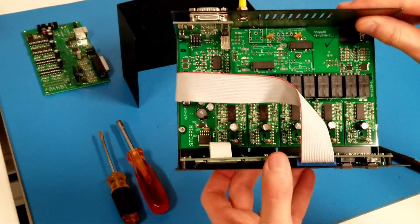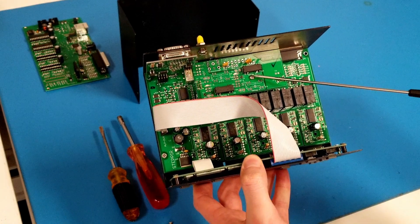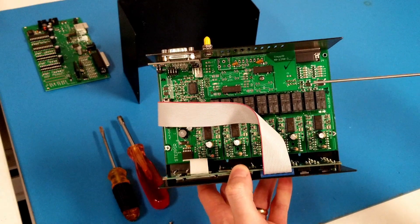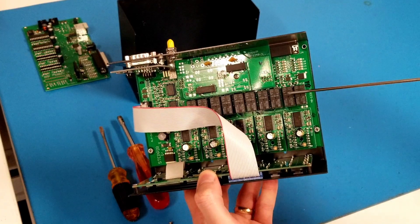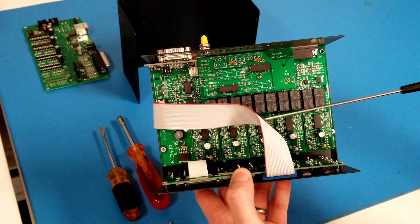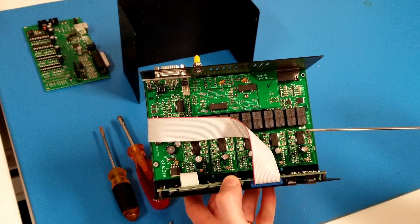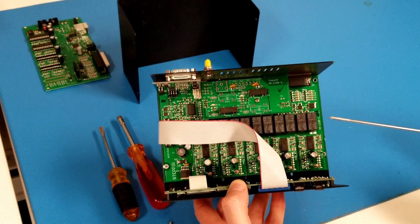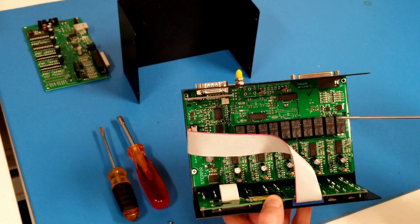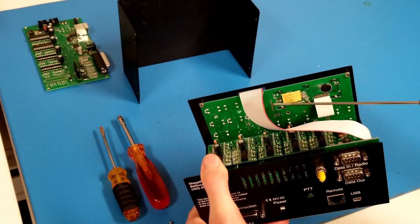With the cover off, I can see inside the controller. There's a transceiver interface board installed and a relay board installed. The driver board here is an ALP5 driver board — you can tell it's ALP because of these relays right here — and you'll see that there are five driver chip modules installed: U5, U6, U7, U8, and U9. This is the newer ALP driver chip module board. I'll show you later how to do the same steps if you have the older socket-mount driver chip version. Additionally, there's the display board with an LCD module.